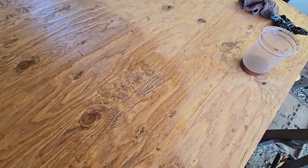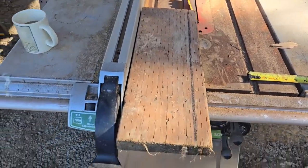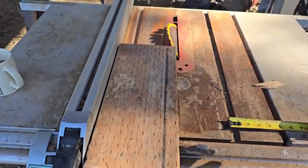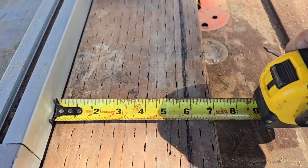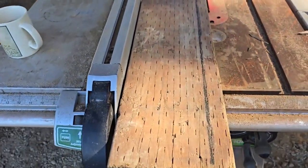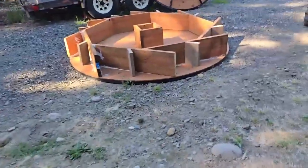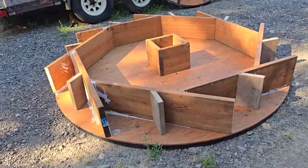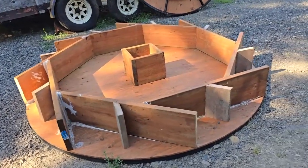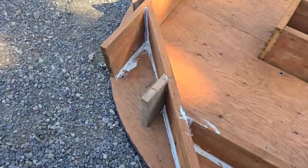With the advice of a few people, I doubled up the buckets on the wheel. I took a pressure-treated two-by-eight — and as you can see it's actually only seven inches now, not seven and a half. I put the table saw out at 45 degrees, ripped it down, then cut the two-by-eight to lengths to match the two-by-twelve that's there, and placed it vertically to double up the buckets. Now we're going to silicone them in.